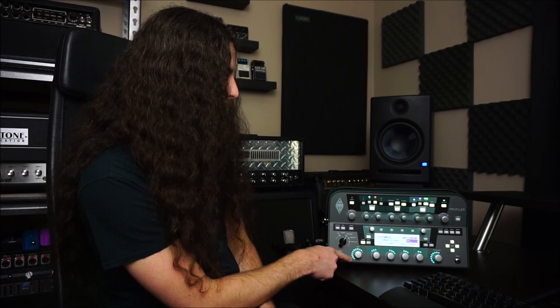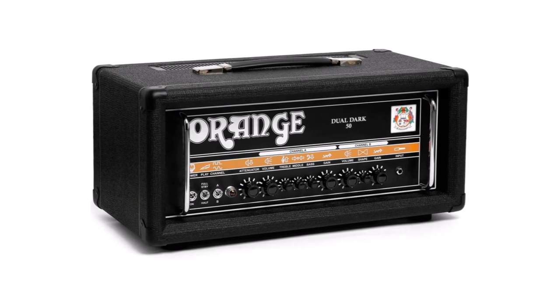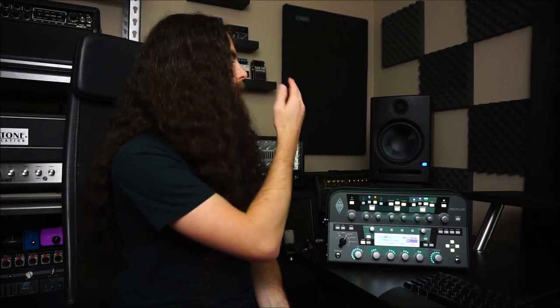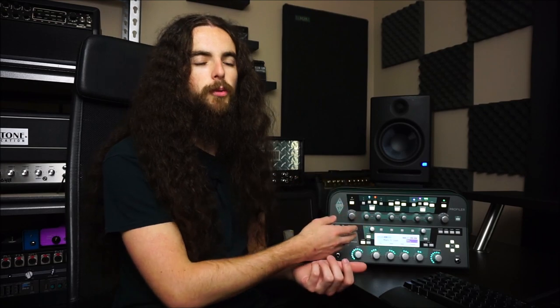It does take a stab at gain because if you have a completely clean amp, it'll show the gain way back here, or if it's really high gain, way up here. But dialing back the gain doesn't really tighten up a flubby amplifier. It just turns down the distortion. That is all to say, if you want an accurate representation of different amplifier permutations, let's say a rectifier type amp all at noon versus a rectifier at sweet spot settings, you have to take separate profiles for each one of those settings, which is why if you go online, you'll oftentimes see profiles labeled like gain 6 and then 4.5.7 for the tone stack and then 6.3.7 for this permutation, because you can go in and tweak afterwards, but it doesn't have the same effect as if you capture the amp with those settings.